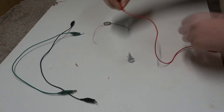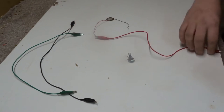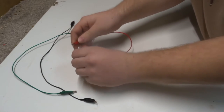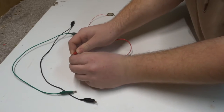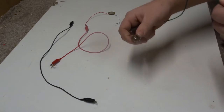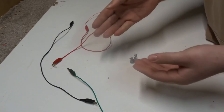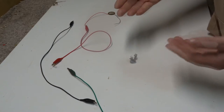The first thing you're going to want to do is connect or solder your positive lead to the positive lead on the piezo to either end of the resistor. After that, the other end of the resistor will then go to the positive part on the jack, which is the outer one. Another side note: the resistor can be wired either end because it is bipolar.